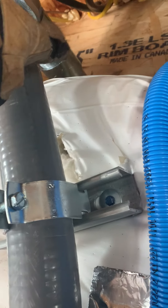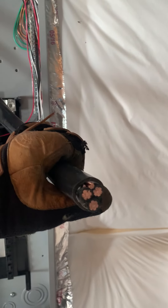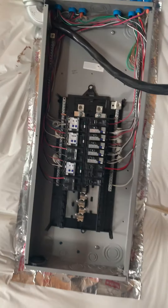That one I did not. I like how I did this here — I could just slip a strut under there if I was in trouble. This is my TC cable number two. He wanted all copper, that's why I didn't do PVC. And that's going to be a 100 amp panel and my 200 amp panel, both main lug.